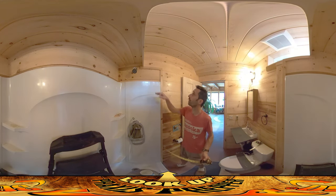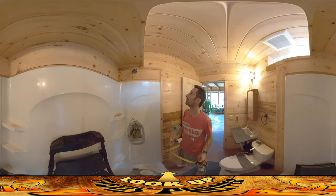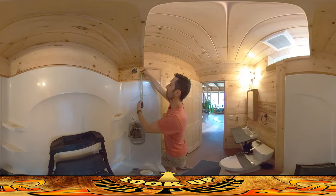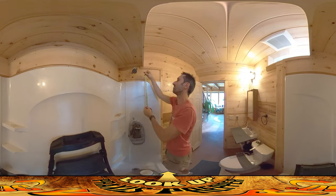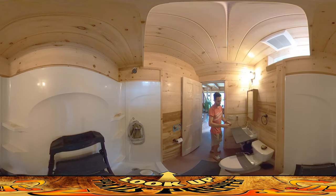I'm going to account for the fact that I don't want the tile to fill up the entire area — I want a quarter-inch bead around it where I'm going to be putting the grout, so I'm accounting for that as I do this. Same from the bottom: to the center of the pipe from the bottom is about seven inches, but I want to account for that quarter-inch bead at the bottom, so it's maybe just a little more than six and three-quarters inches up from the bottom.